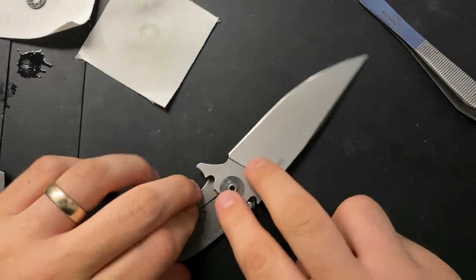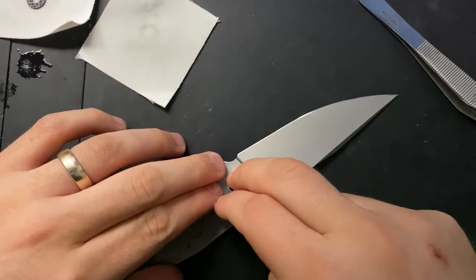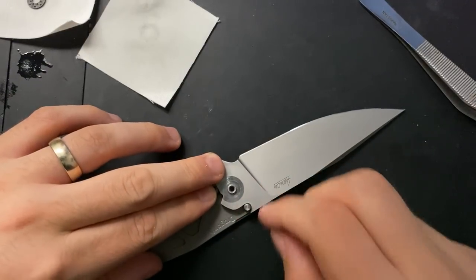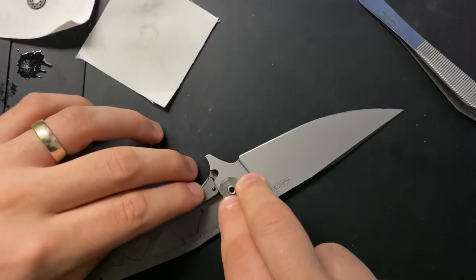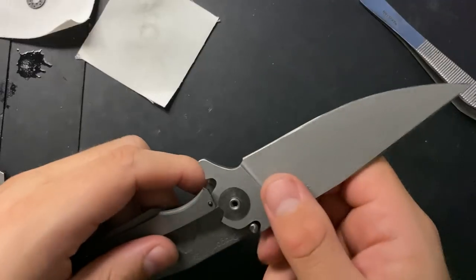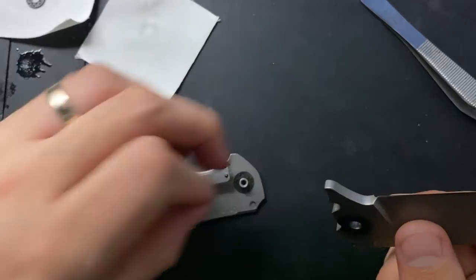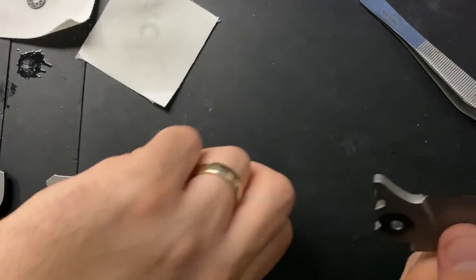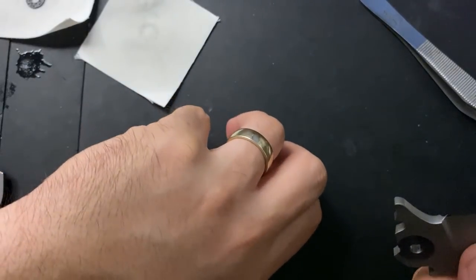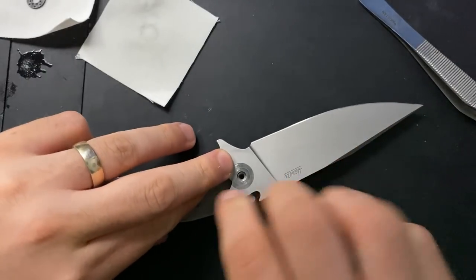I'm going to hold down this lock bar here because it's really desperately wanting to come popping up past things, which is interesting. But that's probably just because the stop pin isn't held on both sides. What's going on here? There are no balls here. Did I reinstall the stop pin upside down? Oh, I bet it's just that the stop pin is moving off to one side. It's deflecting a little bit, and once it's held together on both sides, it's going to be fine.